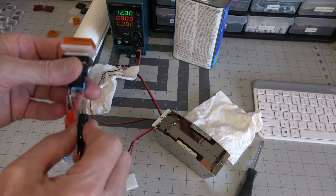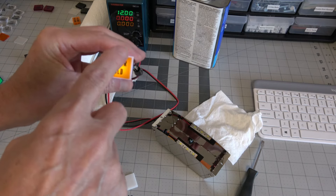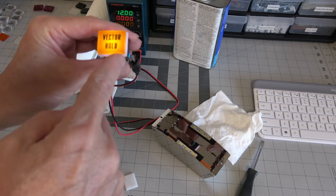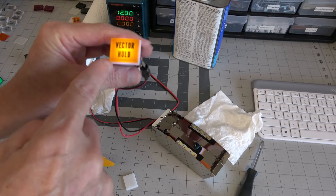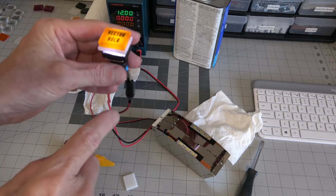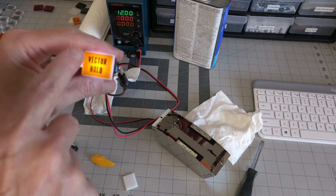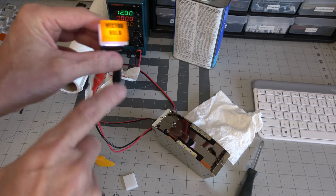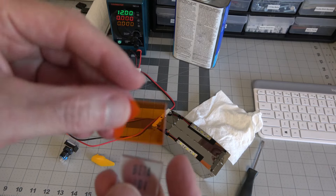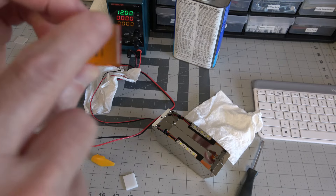Because these are lit switches with LEDs, the key to this is that you don't see any edges when you're looking at the button itself. The tape has to be applied evenly all the way out to the edge of the button with no air bubbles underneath and not jagged, because otherwise you would see it sort of through the buttons. These older style buttons were actually colored and have an opaque backing plate. The newer ones that Craig sells are actually the opposite — clear buttons with a colored backing plate — and that makes it even harder as far as seeing defects in the tape. So it's super important that the tape is completely smooth on the back of the button with no bubbles and smooth edges.